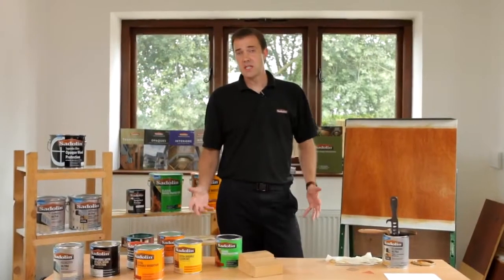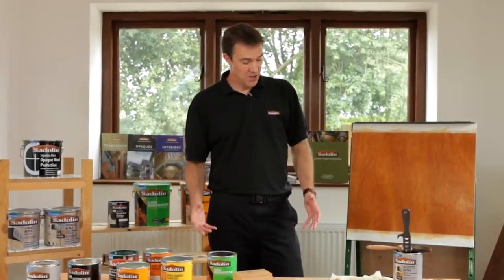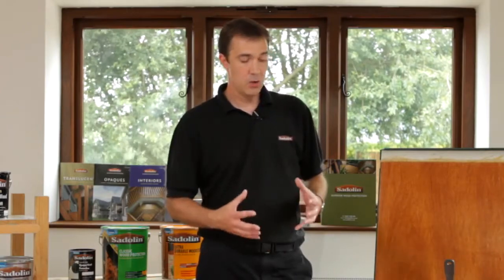We'll now go over some basic tips for protecting your wood for the long term. First, we're going to show you how to make sure that you get enough product on. Systems need to be put on in full — so if it's a base coat and top coats, that's what we do, or if it's a two-coat system we put on two coats. Ultimately we're trying to get a dry film build of a certain thickness in line with our technical data sheets, because that will ensure the durability and weather protection that you need.